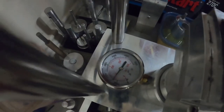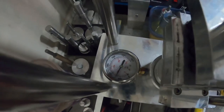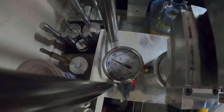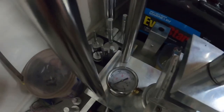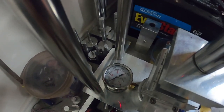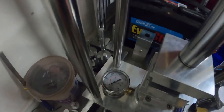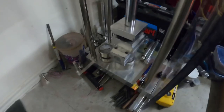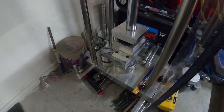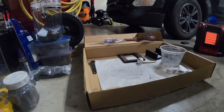Taking it up to 4,000 PSI, holding it there for a second, then letting go. Even at 4,000 PSI, when I let off it dropped to 1,500, now sitting around 2,000 PSI. Sometimes the pressure will actually increase as it sits, which is nice. It's sitting at around 2,000–2,500 PSI — I hadn't touched it for about five minutes. Now I'm going to go ahead and let off the pressure.